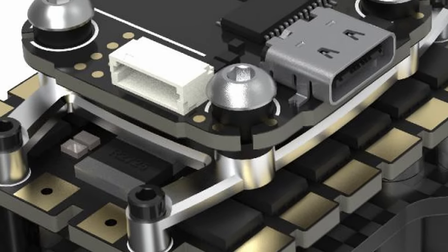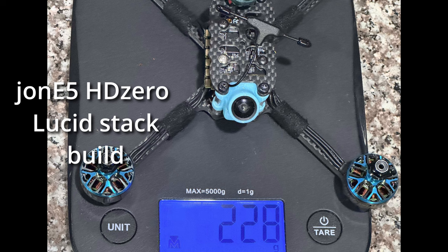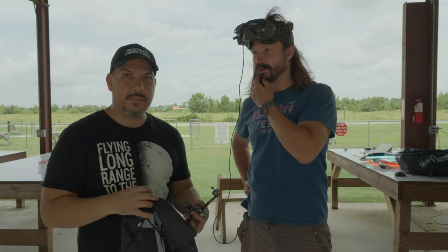What I ended up doing is mounting it as designed with the little bracket, then switched the VTX from the V3 to the whoop board and double-sided taped it to the top. Before the V3 came out, a lot of racers were just using the whoop board double-sided taped because it was smaller and lighter than the V2 — so that's what I've done here and it's working great. What's really going to make or break this stack is how many frame manufacturers design mounting solutions for it. On the racing side, Din Drones is the only one so far, and it's one of the more popular racing frame options right now.